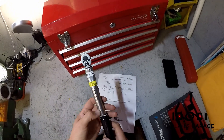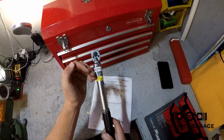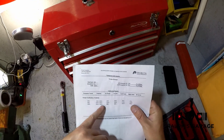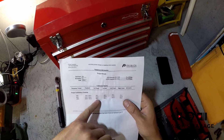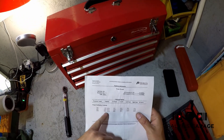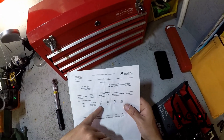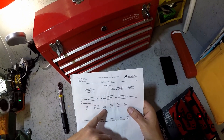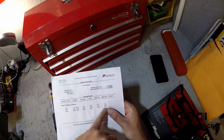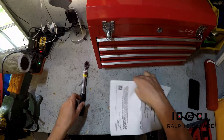Then they check it at 100%, which is 200 inch pounds. Generally you don't want to use a torque wrench at the high or low end of the scale — you want to stay in the middle. But they tested it at 100% anyway, and at 200 inch pounds it put out 206.1. That's a little high, but I'm not going to use it at 200 — I'd grab the next size up. The low limit is 192 and the high limit is 208, so it was closer to the high limit but still within limits.